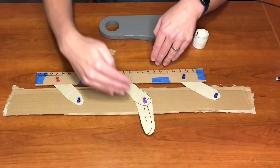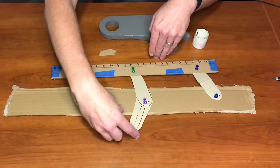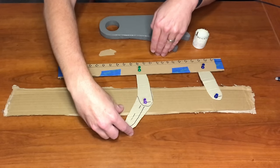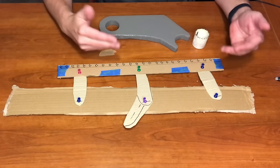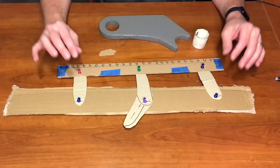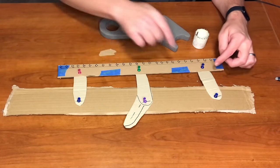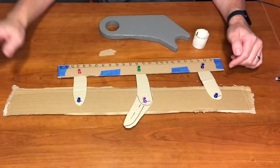Same thing. Chain is right here where my fingers are. And when it goes back up, my hand stays in the same spot as the trough returns to the upper position. And then at that point, it's ready for another cycle. These are monitored in both the up and the down position. There's multiple proxies in the top and lower position throughout the entire thing.